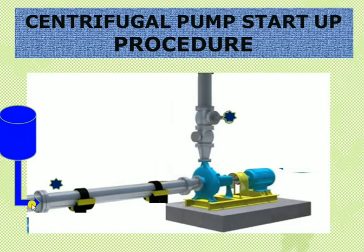When there is suction lift, we should prime the pump with additional liquid. The suction line will have a foot valve or check valve in closed condition. When we introduce water, it fills the suction line and whatever air is present gets pushed through the pump casing and bled off to the discharge. This theoretical representation is for the flooded suction arrangement.